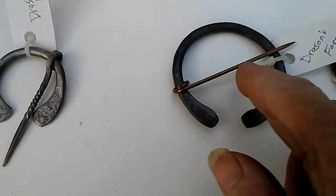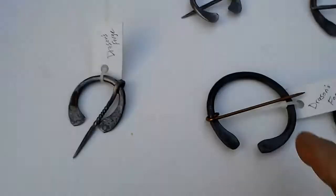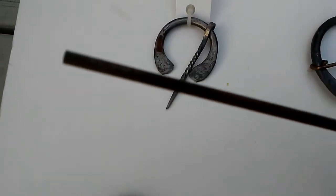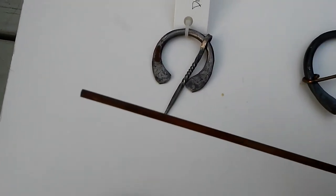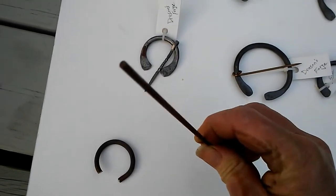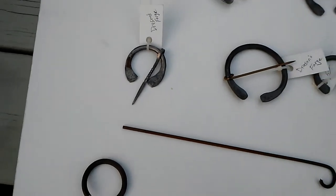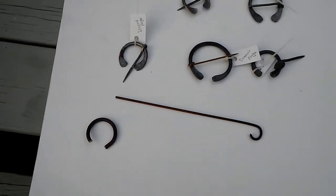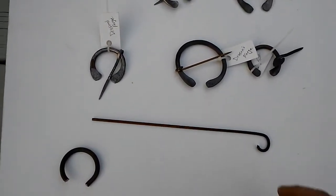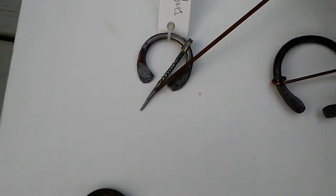I used a piece of silicon bronze brazing rod, and this was actually off in a spring this size, but it was smaller diameter. 1/8 inch, metric equivalent 2.5, 3 mil possibly. I also use electrodes for stick welding. I found some that were junk because the coating, the flux, had been deteriorated by moisture, so they were worthless as welding rods, but they make good solid stock. And from the stock there, I end up making the pin.